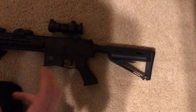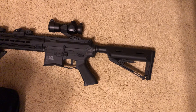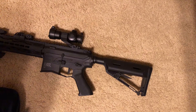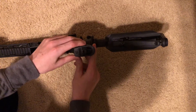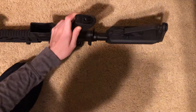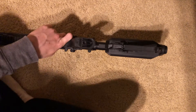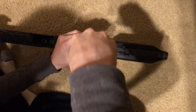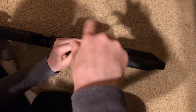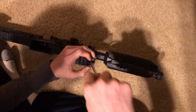To work on your airsoft gun, you don't actually need to fully take it apart — this is a tutorial on how to just get the motor out of the grip and back into the grip. What you want to do is flip up your gun like this. You're going to see a screw here, a screw here, and a little thing in the middle. You can ignore that middle piece for now. The screws are a different story — we need to unscrew them. Try not to strip them, because that will end in a very bad story for you.